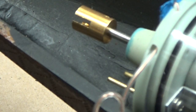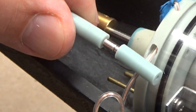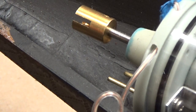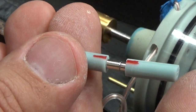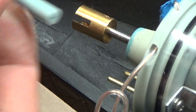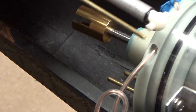I'm going to install the magnetic linkage connectors here — these are click-ons. I've got the old style and a new style; they both work equally well. One thing I like to do at this point is mark out which pairs match to which, so when I do the other side I know which magnets go with which. I'm going to slip this over the linkage end on the cylinder, secure it in place, and then we'll be able to take length measurements to attach the other end to our rear section.